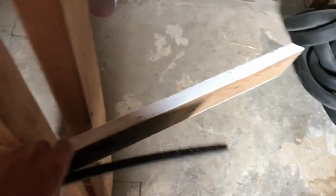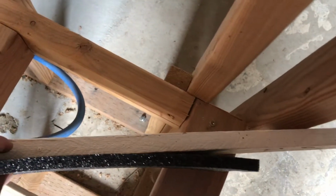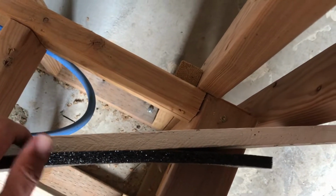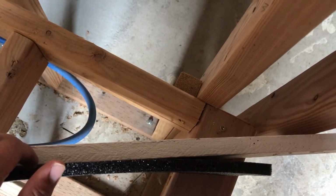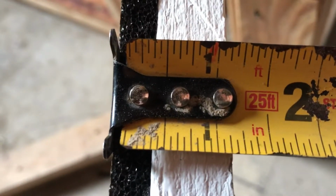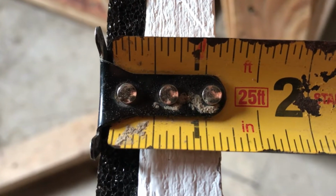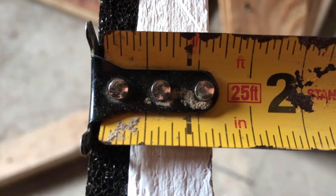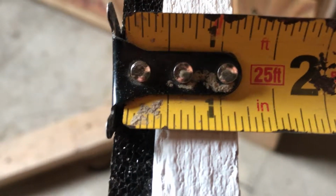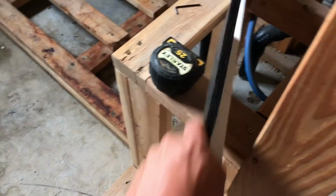So now this board is a little thicker than I like. It's 3/4 inch. But this is a little bit less than ½ inch. So it all equates to about 1 inch. So that lands at about 1 1/8 inches. Almost exactly 1 1/8 inches. Which is good because that leaves room for things like mortar and the epoxy thickness and stuff like that. So that should be good.